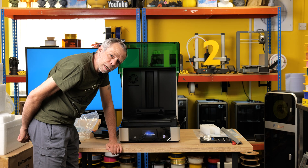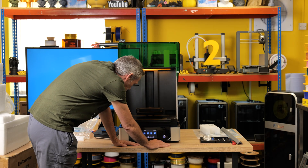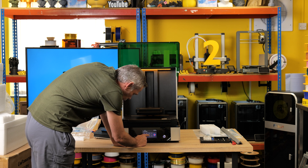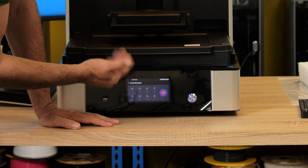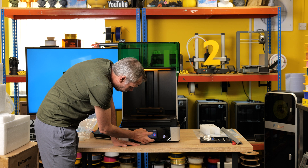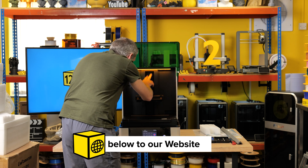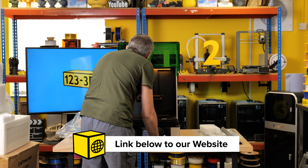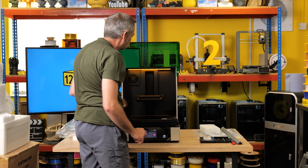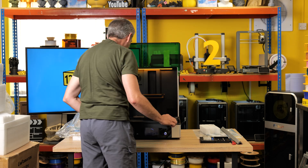Let's try and power on — it's alive! We have nice ambient lighting, it looks like a warm summer's glow. I'll move the build plate up. On this UI there are different increments: we can move up or down in increments of one millimeter, 10 millimeters, or 100 millimeters. I'll send it up 100 millimeters — it is very quiet and very smooth. This drive mechanism is different to the GK2: we have a ball lead screw on this side behind this cover, running up and down on linear bearings.